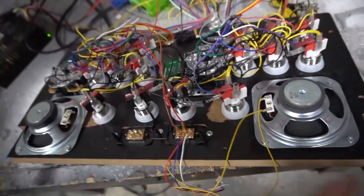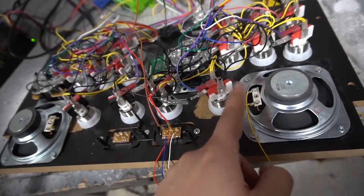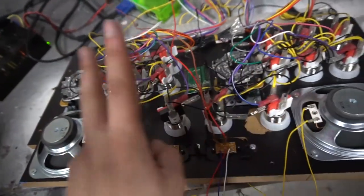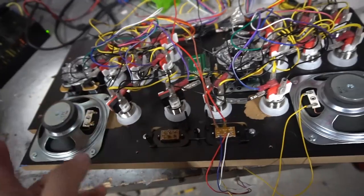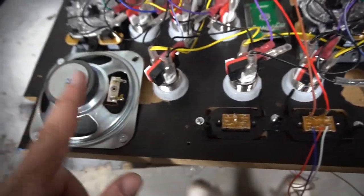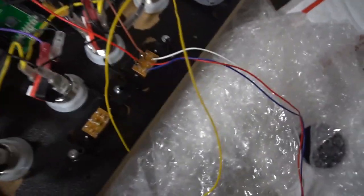It's not really set up for stereo speaker sound, but we're going to connect this speaker to this speaker and then take the yellow ends, re-solder them to make sure they're tougher, and the yellow ends are going to go into the switch. In reality this is just going to turn on together - this isn't 2.1 sound, this is just mono. It's really mono - just one sound through two speakers doing the same thing, so there's no left and right switching. The wires came off my old one so we're going to re-solder and connect it, with one straight wire going to this giving power to both speakers.